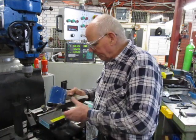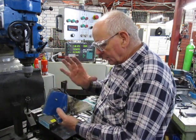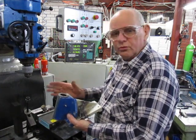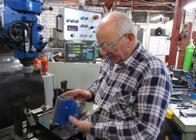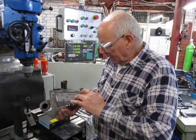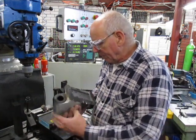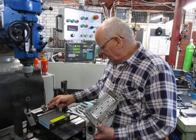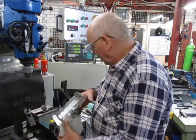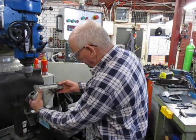Now the biggest problem I had, what I decided to do is I welded it up just a bit to hold the whole thing together so I could reverse engineer it. But in order to machine this, what I opted to do was machine out a trough in here, and put a plate in and screw that in. So I machined up a spigot from a hex bar, because there was just no way of capturing this, and I fitted that on.